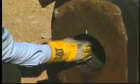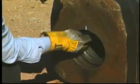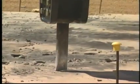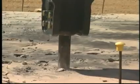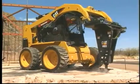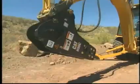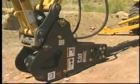Every 50 service hours, or once per week, you should remove and inspect the hammer tool and lower bushing. Proper guidance of the hammer tool by the tool bushing is critical to the performance and durability of the hydraulic hammer. Therefore, inspection of both the tool and the lower bushing are a very important part of scheduled preventative maintenance for your Caterpillar hammer. To remove the tool, position the hammer on the ground in the horizontal position.